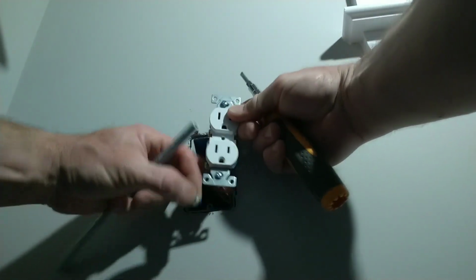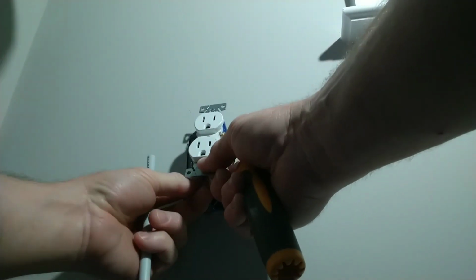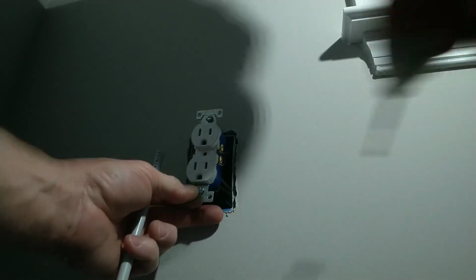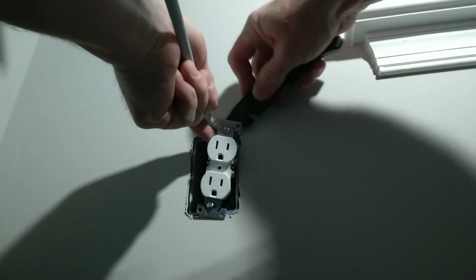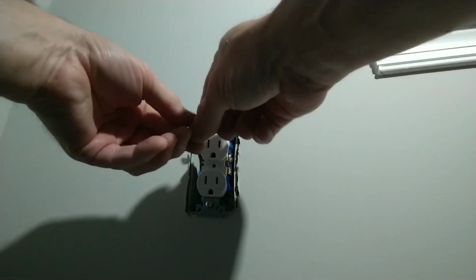And I'll take this outlet, make sure your grounds are at the bottom, make sure it's not touching the neutral or hot. I'll do the bottom side first, get that spacer put on, and then I'll set it into that bottom hole. And then all I'll do is cut a spacer for the top, set your tubing up there, cut a line across so you can see your scribe, and I'll cut one for the top.